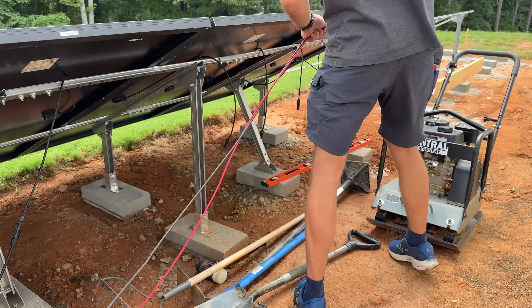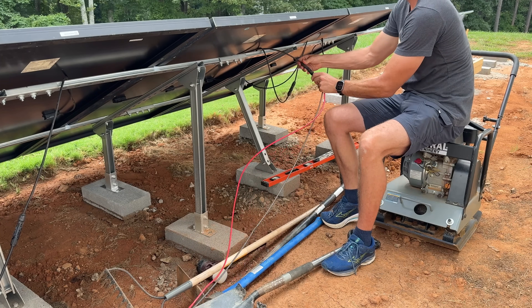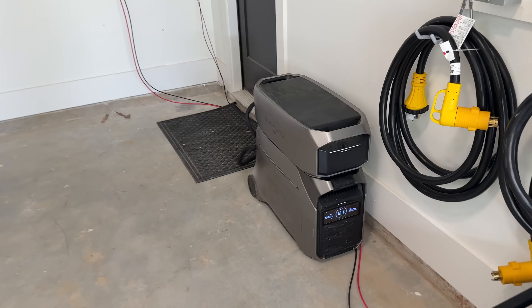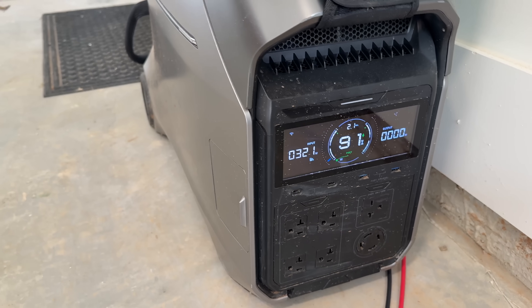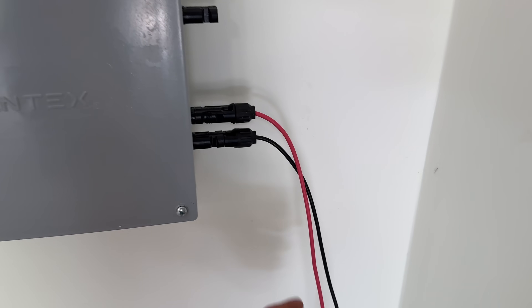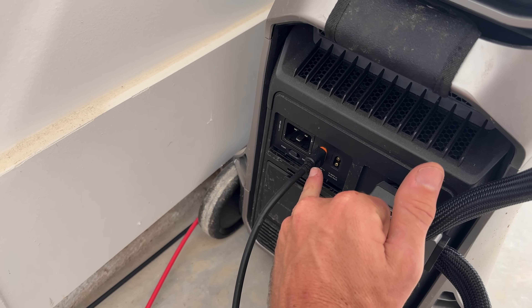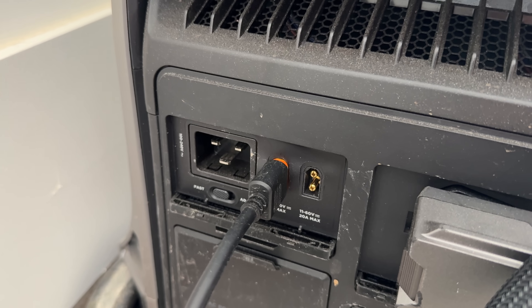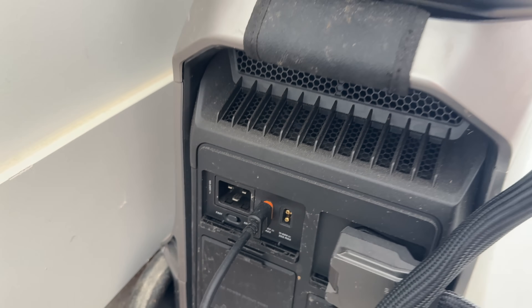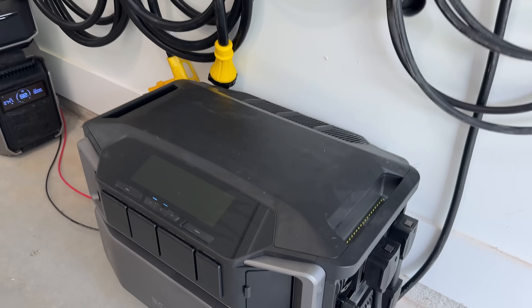To get the two panels into the Delta Pro 3, I wire those in series — connecting the plus and minus — then connect the free ends from the 405-watt panels to extension cables and into the outside junction box, passing through to inside the garage. Here's the Delta Pro 3 — input is at 320 watts though it's bouncing around with clouds. That comes through an adapter cable to an XT60i connector, which is a standard connector in portable power stations. The Delta Pro 3 has two solar inputs: one handling 1600 watts and another handling 1000 watts, so you can bring in up to 2600 watts of solar total.